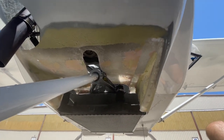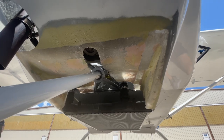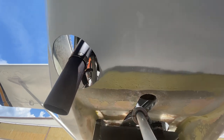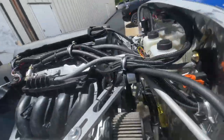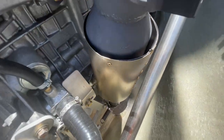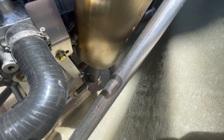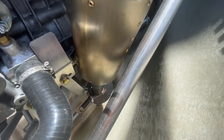Kathy's going to play with that when she gets it back. So that's the bottom part, and the nose wheel. We ended up having a big opening for the exhaust. The reason for that was initially we had an augmenter tube that came through here and we decided to make that smaller. We basically used all of that idea of a shield — a titanium shield — but we did not bring it down as far into the cowling as we initially had. We left the big opening, and you can start with a smaller one and just kind of work your way up.